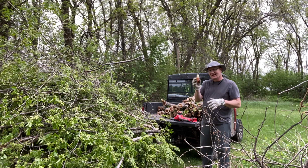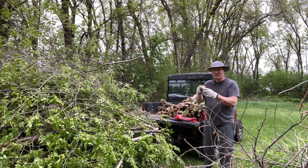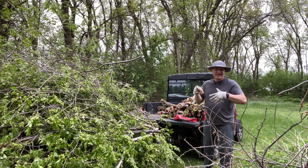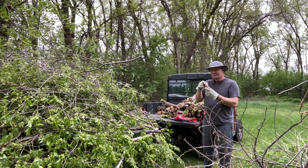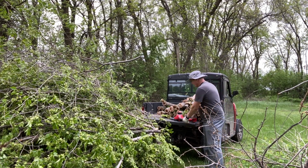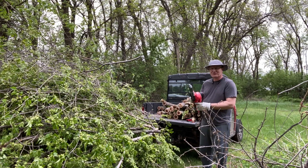Now, one little thing with this is a traditional chainsaw has a reservoir for bar oil. On this little one, you've got a little bottle, you put in your oil. This can be bar chain oil that you get from any chainsaw shop, or it can be 30 weight oil. It also mentions using vegetable oil, which I've never done with a saw. That's kind of an intriguing thing.